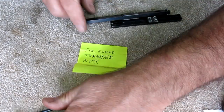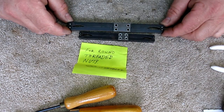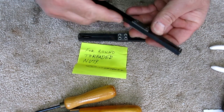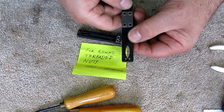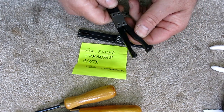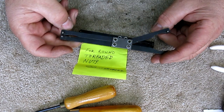And then these, okay, these are really cool. I like these here. These are adjustable spanners, but you see how they're made? They're made out of bars, right? So they got one continuous bar here, and then this one is a hinge, so now you can get an adjustable pin spanner out of it, right? And it's relieved in the center there. So that's kind of a clever way to make those.